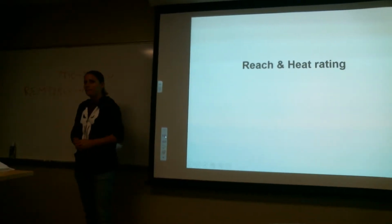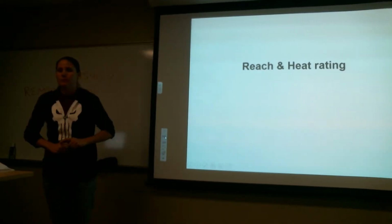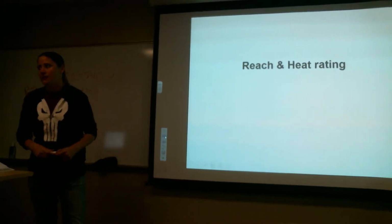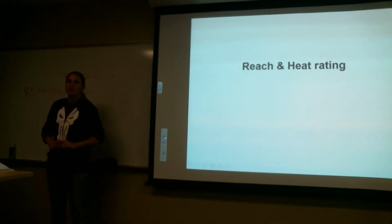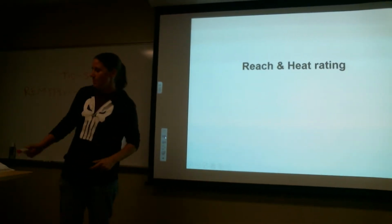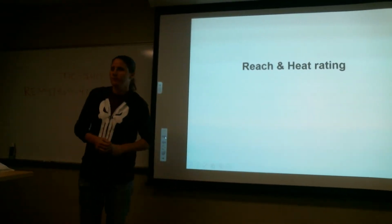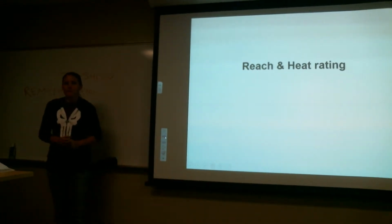Is that a 540U? Yeah, it's a TIO-540U. The type certificate data sheet will actually tell you to reference the Lycoming service instruction 1042AE. It's a Champion. You also can look through Champion for their spark plug for that. But Avalon should have it. Yes, but I recommend going through the type certificate data sheet first. There's a Champion spark plug application chart which has all the Champions.